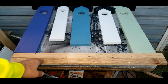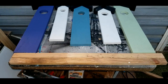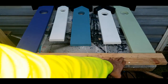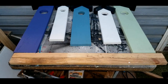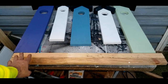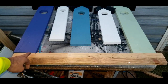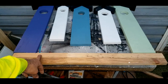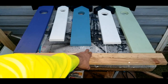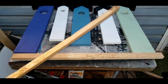And real quick, when you get your boards cut for your layout right here, guys, go ahead and paint your boards. That color is up to you also. Only the middle will be exposed right here. So I got a lot of white paint on hand, so I'm just going to paint my 2 backer boards white, and then I'm going to lay them back up and do the same measurement layout. I'm going to mark this board on the board, then go over 2 inches, then mark that board on there, then go over 2.5. Mark these boards, go over 2.5, same thing. So go ahead and get your backer boards painted also.